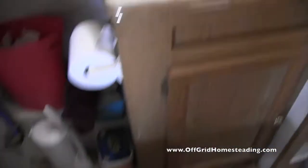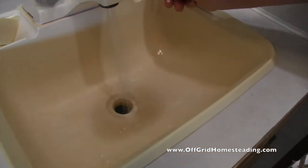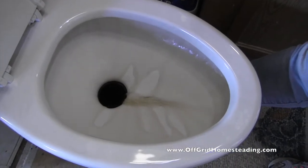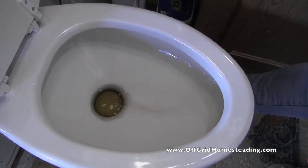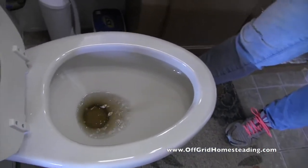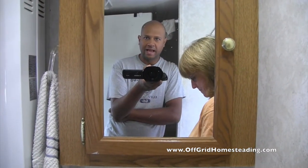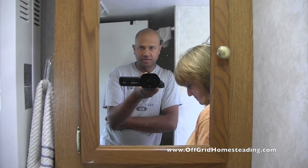I think there's just a blockage. We're going to go down and work on the spring in a bit, put new cement in since it's all dry. From what I can tell, there's a high iron content in the water along with manganese. Together, they kind of eat each other and create this black sludge that is being picked up by our thousand mesh filter, the Rusco spin-down filter.